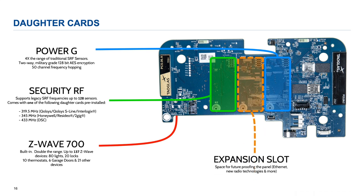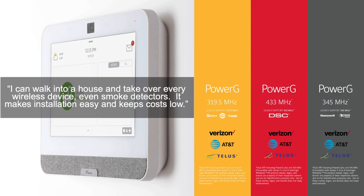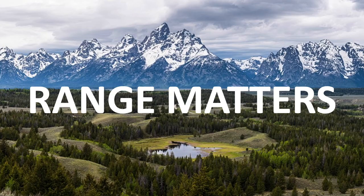Lastly, we have an expansion slot. This allows us space for future-proofing the panel and for developing new daughter cards like Ethernet, new radio technologies, and more. Put this all together, and the IQ Panel 4 comes in 3 different dual SRF flavors, ready to go out of the box. The gold box is Power-G 319, the red box is Power-G 433, and the silver box is Power-G and 345 MHz.